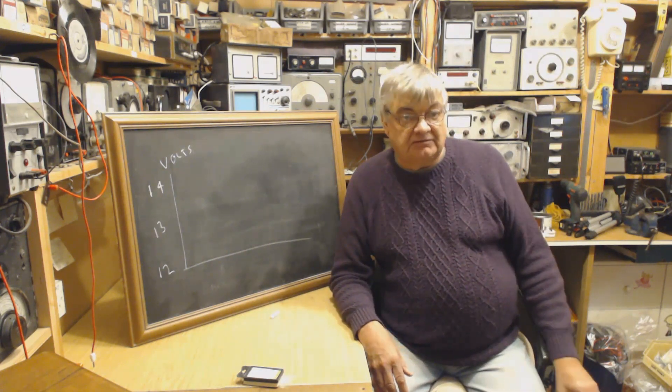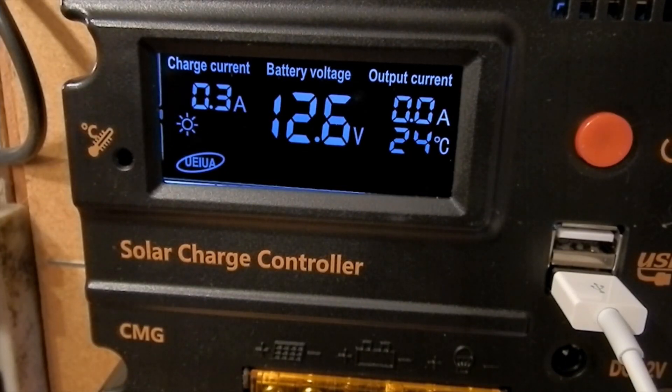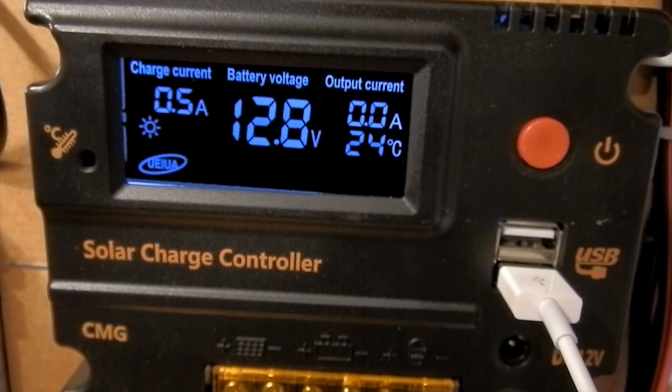Have a look at a couple of the video clips I've made. It's fairly early in the morning at the moment, so the sun isn't up. Sorry about the grainy video, there's not a lot of light where I'm videoing this controller. But you can see there's 0.2 amps — 200 milliamps charging — battery's 12.6 volts. That's now gone up to 0.3 amps, 300 milliamps, 12.6 volts. Now coming up to half an amp — 500 milliamps — as the sun is coming up, 12.8 volts.